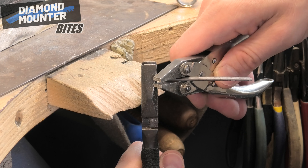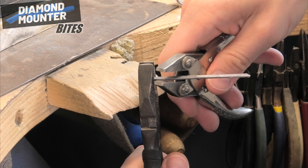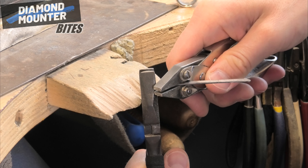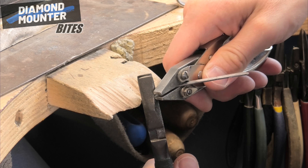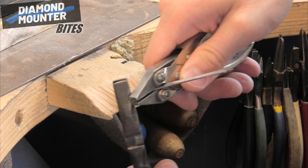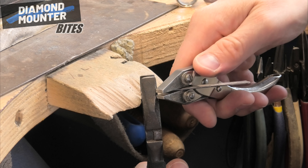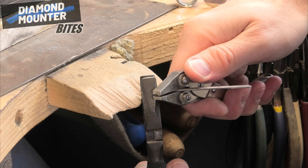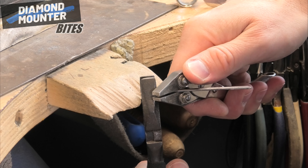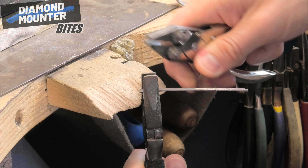You can literally see marks on my pliers there, and that's a bit scuffed up as well. I just squeeze these tight and think about holding them sturdy, so you want to find a spot on your bench peg where they're not going to slip about. Put strength into this but with control — this hand I'm squeezing quite tight, trying to hold it still, and then with my whole arm right back to my shoulder, just tweak it back.